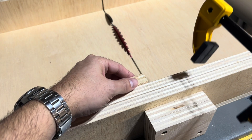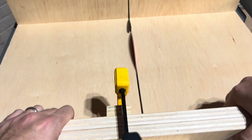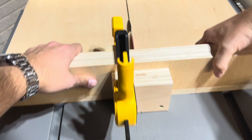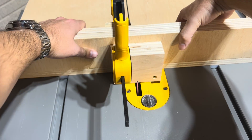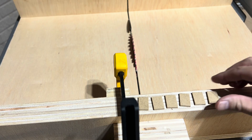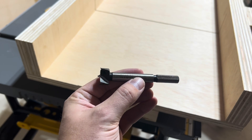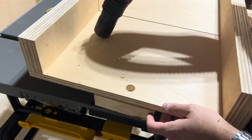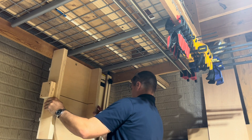It's time to test your new sled. Simple scrap lumber can be used as a stop block with a clamp to make fast repeatable cuts. If space is tight in your workshop I have a storage solution for the sled as well. I marked the midpoint between the fences and one inch over, placed scrap lumber underneath both sides of the base, and used a three quarter inch Forstner bit. Lumber underneath helps avoid tear out and a shop vac makes clean up quick. I have a video on the overhead lumber rack I used for clamp and jig storage.